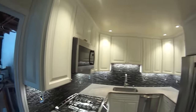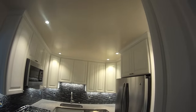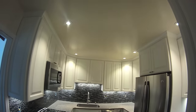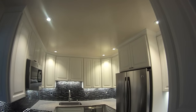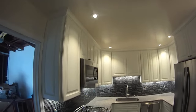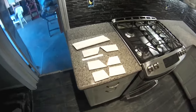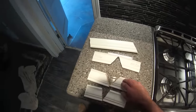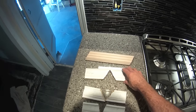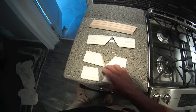The next day I came back in, cleared my head, and said: alright, it's been a while since you've done crown molding — go back to the basics. When all else fails, clear the slate, go back to square one. Square one is making a cheat sheet for your cuts: an outside 90, an inside 90, and an inside 45.